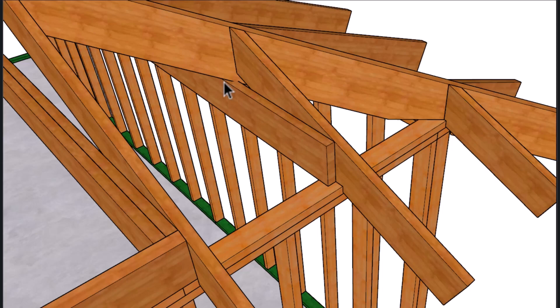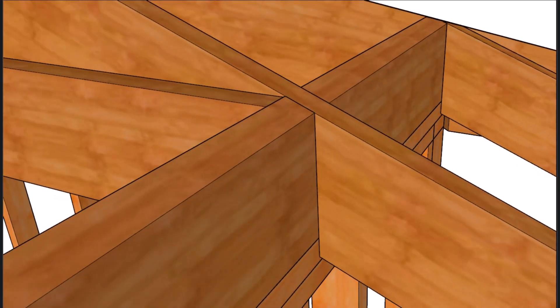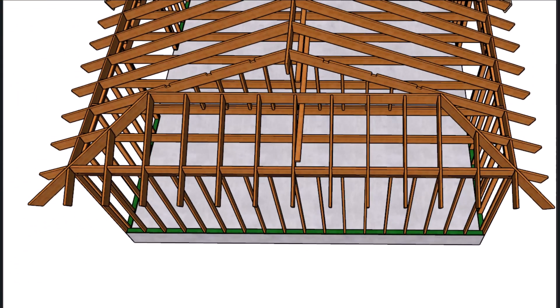If the hip or the ceiling joist was going to be larger, you could see where we could have a problem. I held the ceiling joist back a little bit so we could run our blocks through — you can always run the ceiling joist to the edge of the wall framing and butt the blocks against it. The minimum that a ceiling joist can sit on top of a beam or wall framing is an inch and a half; here we have two inches. Let's go ahead and install our shaped blocks — you can see where we have an angle at the top to create a nice perimeter connection to the roof sheathing through the wall framing.